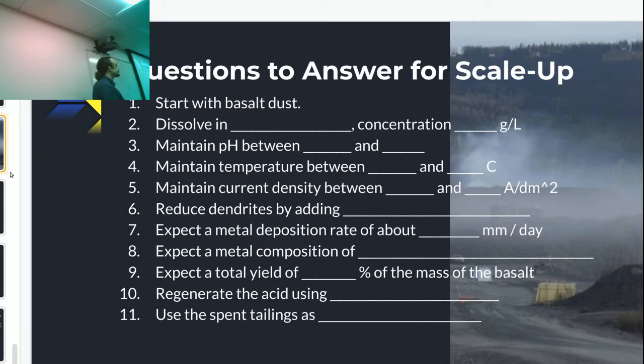Question about hydrogen embrittlement. That may be a problem — you may actually have to take the steel parts out, put them in front of a solar furnace, and bake the hydrogen out. Definitely possible. Question about bubbling forming right on the deposit — yeah, it may actually be causing problems because it could be effectively eroding the steel plating. The current efficiency being 30% indicates I'm definitely losing a lot of steel or electrons somewhere. I don't think there's quite that much hydrogen. The steel plate I passed around is not appallingly brittle — it is a chunk of steel, you can grind it, it does seem like you could make a knife out of it.